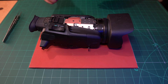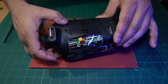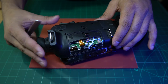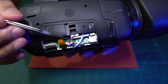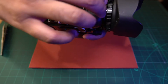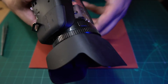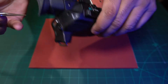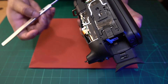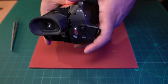The last piece you'll need to take off to get to the power adapter is this side piece here. Before you do that, you're going to have to disconnect two cables — this cable here and this cable here. Once you've done that, open this section and there are a couple of screws inside to remove. The second set of screws runs from here all the way along the bottom. Once you've taken those screws off, this piece will just come off.